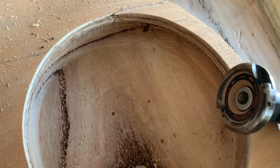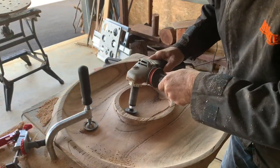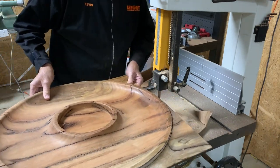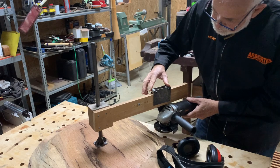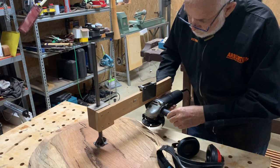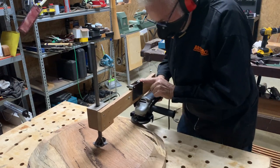You could actually do a whole lot of bowls using this sort of technique — it would look like they're being turned. I'm going to use the bandsaw just to cut this off, and then I'm going to use my jig to round that. I've set it up at a set height. You can see the jig will keep going until it reaches the stop, which is the screw that I've put in there. And what I'm going to do is machine the bottom of the bowl to a lip, which should be the complete bottom of the bowl, and then from then on I'll sculpt it down.